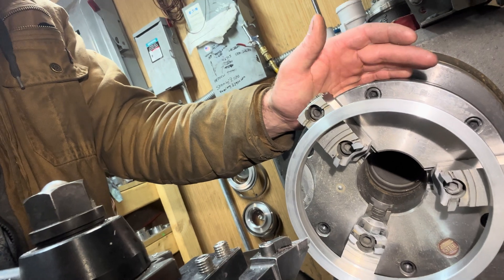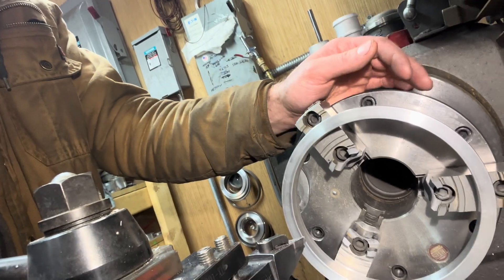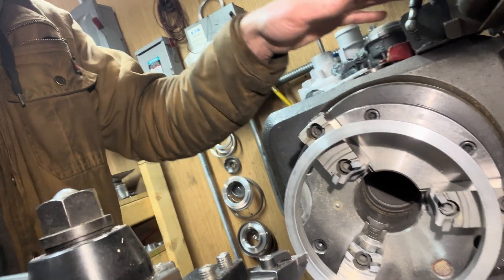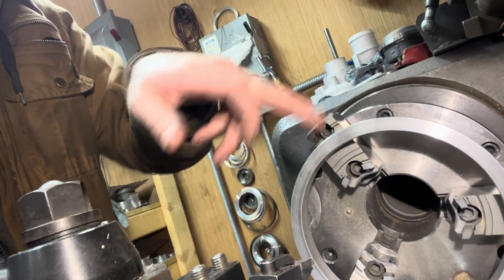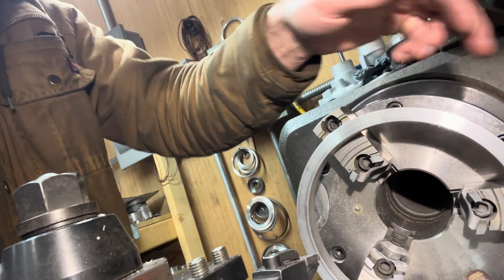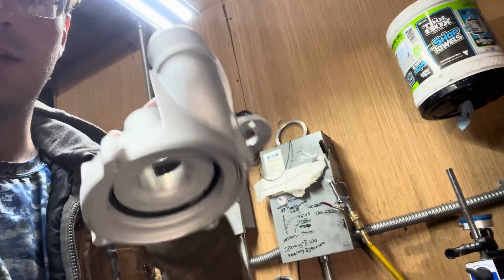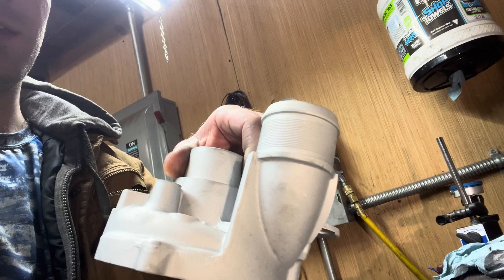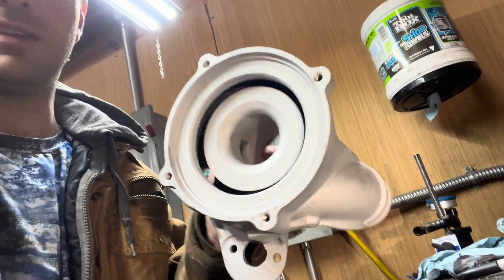It's actually two different sizes. This is important because you need to get the jaws to the proper size so you can get perfect accuracy when you're cutting parts. So I cut this to put on my jaws here, and then I'm cutting this section so that I can grab the Mini Cooper compressor housing on the back so I can surface the front, and then I'll surface the front so I can grab it on the front and machine this accurately.